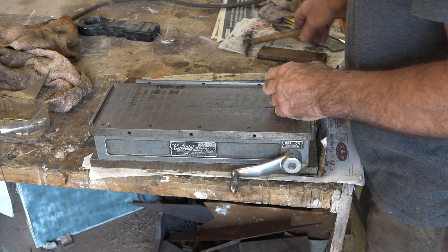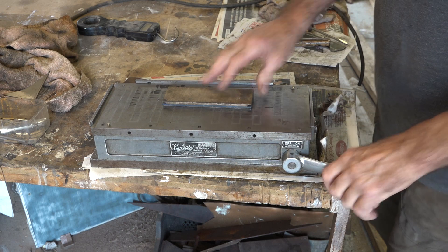It's adding a little bit more magnetism but nothing massively noticeable. I had resigned myself when I got the surface grinder and used this chuck for the first time - the steel was just skittering and moving - I thought I'm going to have to buy a new chuck. But I'd seen people re-magnetize magnets and I had to have a go. I've re-magnetized the magnets and increased the power somewhat, but it doesn't really seem to make a massive difference to the chuck. This chuck is too big anyway - the Herbert only grinds about 10 to 10.5 inches and this thing is probably 14 inches. Thanks for watching and see you in the next video.